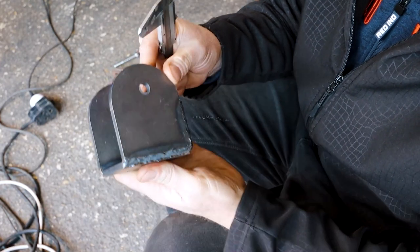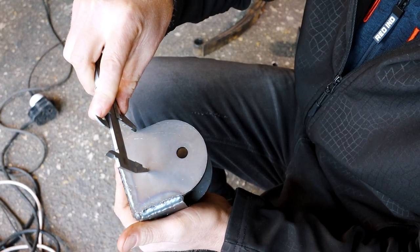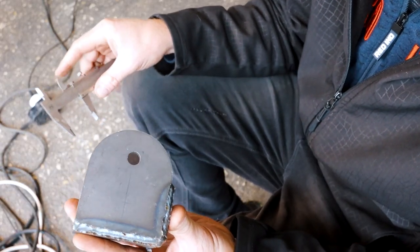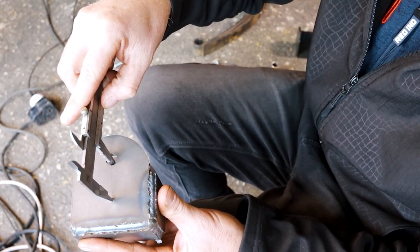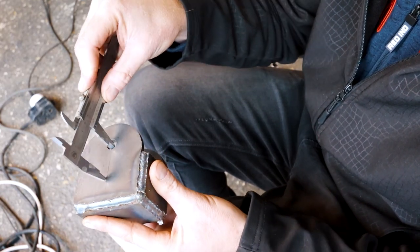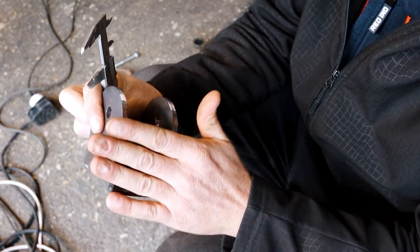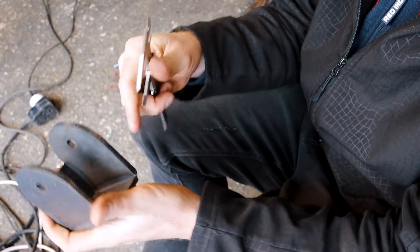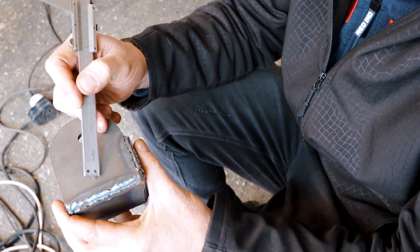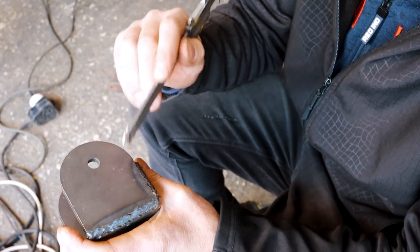Because I know this thing is perfectly square and the holes line up perfectly, I'm just going to work from the existing hole to drill down. I locked the vernier on a certain size — always use an old vernier, don't use a nice fancy one for this. I basically make a line across there, and then for the one down, I lock it for whatever size I want and make a little line from the hole. That way you get it exactly on all of them with the same length. It's an easy way to get those holes right — you don't want to go one millimeter up or down because then the bolt won't slide through. I'm going to start with a two or three millimeter drill to locate it perfectly, because big drills tend to wander around if you haven't got it clamped in like a milling machine. I'll make a small indentation, then drill the 12.5 millimeter hole out.